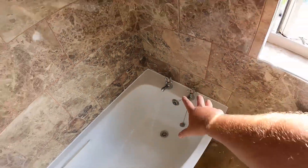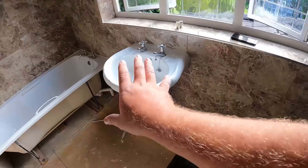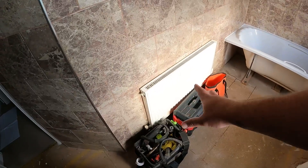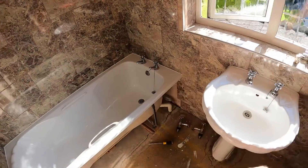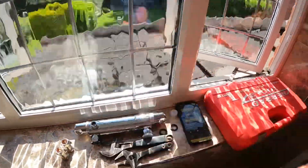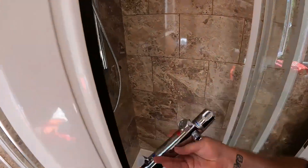We've got the hot draining down now. As soon as that's done we'll get the bath taps swapped over, get the new bar mixer fitted on there, and get the isolation valves on there. Then we can get the water back on and work from the isolation valves so the water's not off for the rest of the house all day, and begin getting everything taken out and measured in. We'll get that vanity unit put into place and then work out exactly where the toilet is going to go. We're leaving the radiator because draining the heating system in a house this big would be a bit of a pain — they're happy leaving it and they'll give it a lick of paint or put a cover over it.